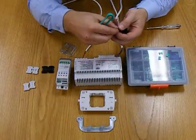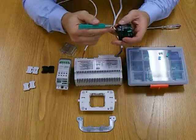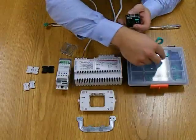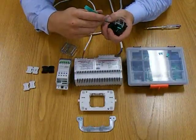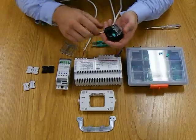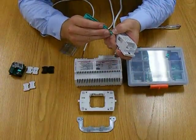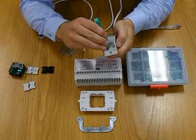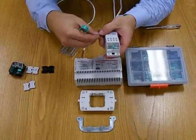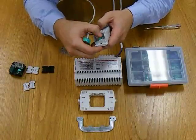For instance, if we put into the area component the number one configurator — and you'll know where the area component is because down the side there is area, point of light, modality — that's obviously for the two switches. So if you put in the first switch area one, point of light one, and we put the same thing into the relay. The relay has area, point of light one, point of light two, point of light three, and point of light four. So we put the one configurator into area, and the one configurator into point of light one.